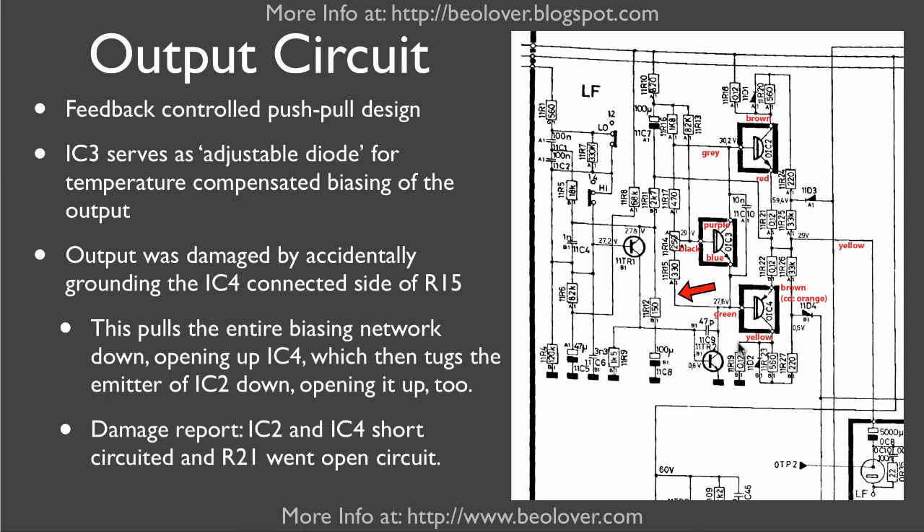The manual prescribes measuring across this resistor, which can also be done by connecting one lead of the multimeter to ground and the other to the package of IC4, which is the collector. But if you do it like I did, you need to adjust for twice the voltage — the manual prescribes 7.2 millivolts across R19, so I adjusted here for 14.4. I verified that by doing the single-resistor measurement too, so this is a valid approach.